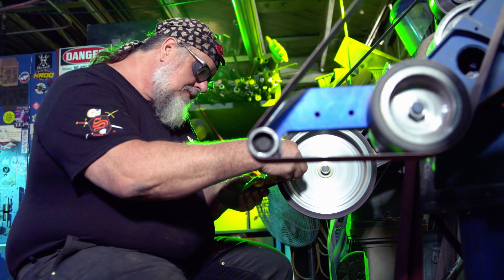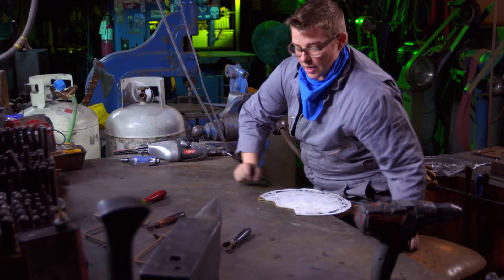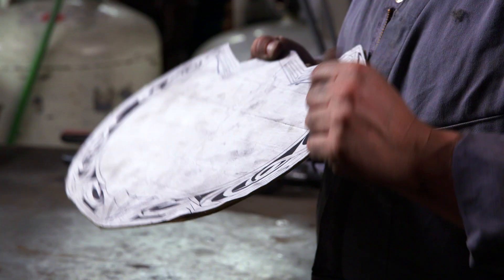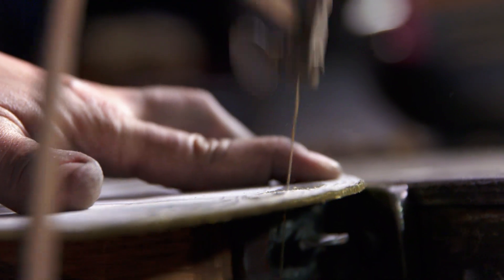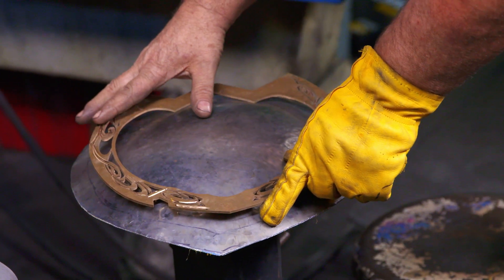It's hollow — very lightweight brass, but it's going to look like solid thick brass, hence keeping the weight down. Here I have three different length jeweler saws I'm going to be using for our shield. I'm just going to follow the lines that I have on this pattern. One down, 20 more to go. I now need to dome it to match the contour of the shield here.